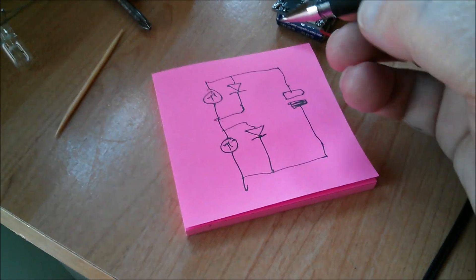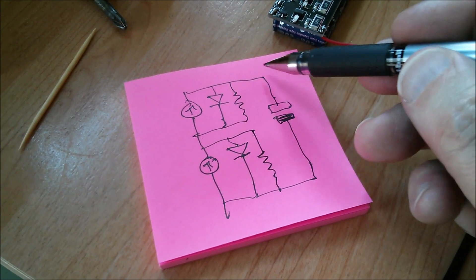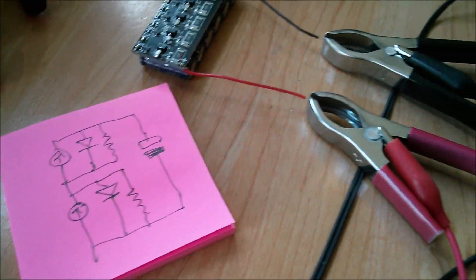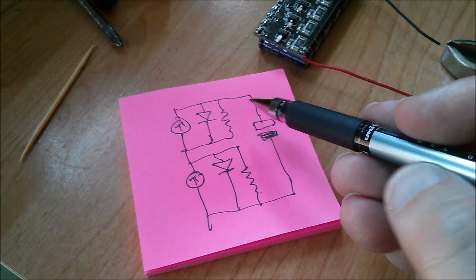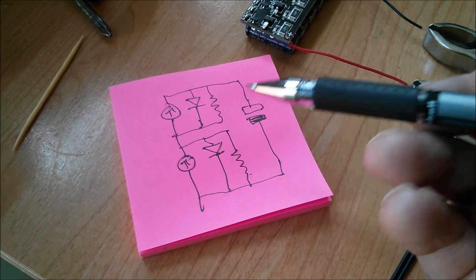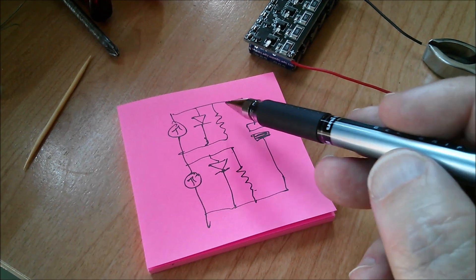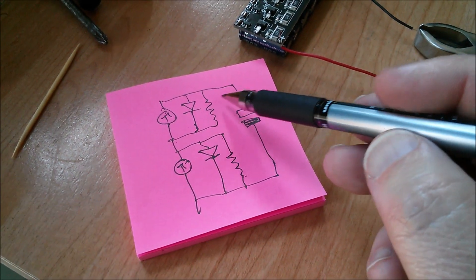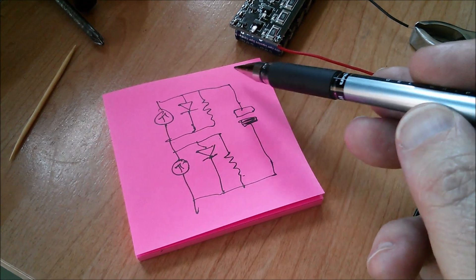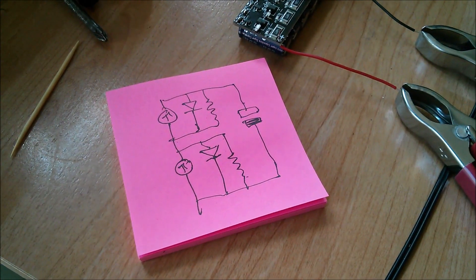What the equivalent circuit also has is a resistor in parallel — these are very high-value resistors. So it's actually these resistors that will eventually cause discharge. I've got to be careful not to short these two together because that's at 16 volts. It will eventually discharge through these resistors, but being very high value, the drain on that capacitor is very, very tiny — it discharges very, very slowly. Of course the equivalent circuit of a solar panel probably has more than this: some series resistance, capacitance, inductances — every component in the book somewhere. But the diodes don't conduct because of their forward voltage, and the resistors, being very high value, mean the drain is tiny.